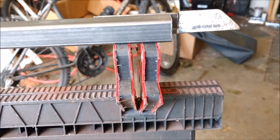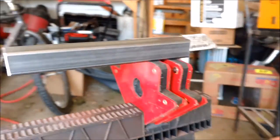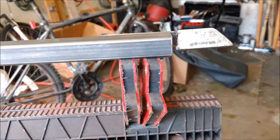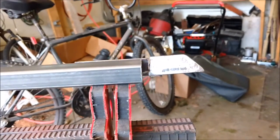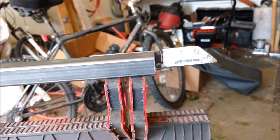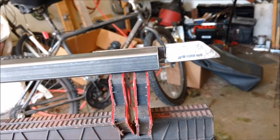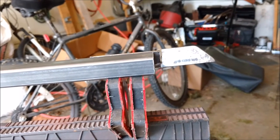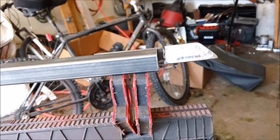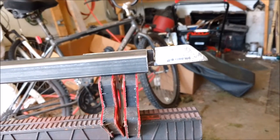I've got welding magnets here — they have different angles that are supposed to be precise and hold everything together while you're trying to weld. Right now I'm just gonna make some tack welds to hold everything together, then finish weld everything a little later. Tack welds are easy to cut off if I need to. So I'll tack weld everything, get it put in place under the trailer, and after that I will finish weld them.